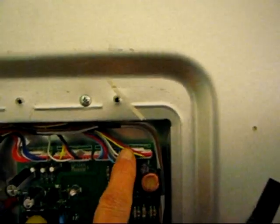Now, the thing to do with this circuit board, once you've unpowered it, is you can unplug all these modular connectors off the motherboard. And I think these are the standoffs right here. You can pinch them down with a needle nose pliers and pop the circuit board off. They're in 4 corners. Here, over here, and one over here. Might be one in the middle there somewhere for bracing. I'm not sure, but I'm about to do that in a few minutes.